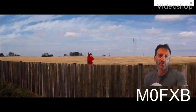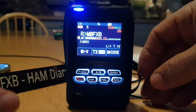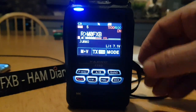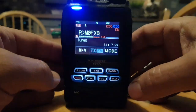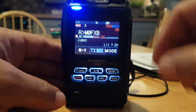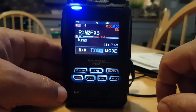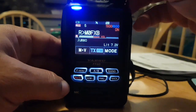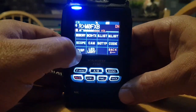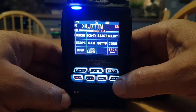This is FXB, Ham Radio Diary. What I noticed about the scope feature on the FT5 and the FT3 is you can only use it when it's in VFO mode. What they've done with the FT5 is they've created a shortcut — memory to VFO. So if we're on a memory channel and we try to push F then Scope, it's not going to allow us. The button won't work.